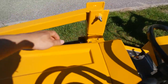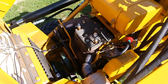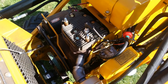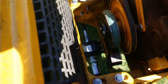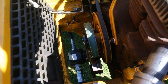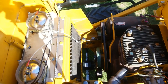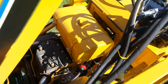Let's take a peek under the engine compartment. Here's the newly rebuilt engine, all using iSave tractor parts — an iSave tractor piston, piston rings, carburetor, ignition coil points and condenser, as well as the air filter. It runs great. I'm operating the hydraulic pump via a split tapered bushing pulley at the front of the PTO. There is no way to disengage the pump, so this is running full time — as soon as you start it up, the hydraulics are live.